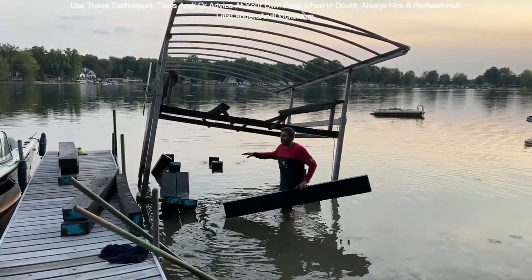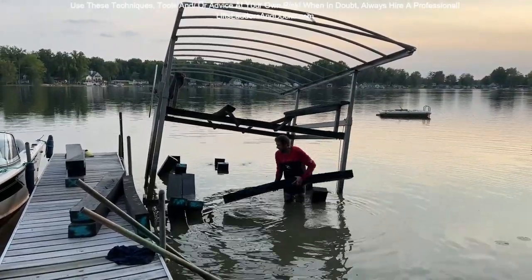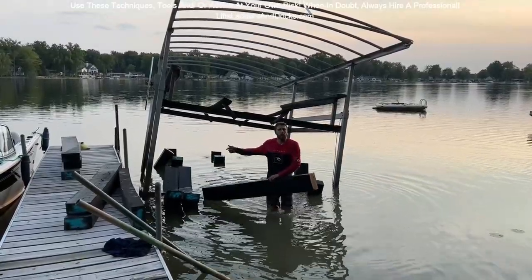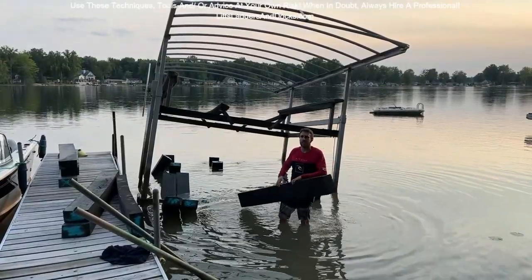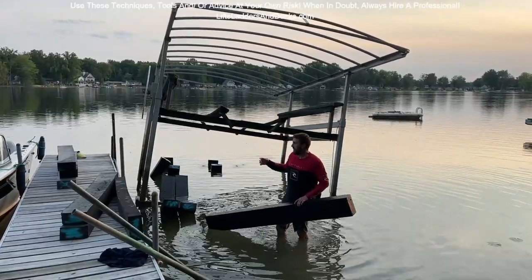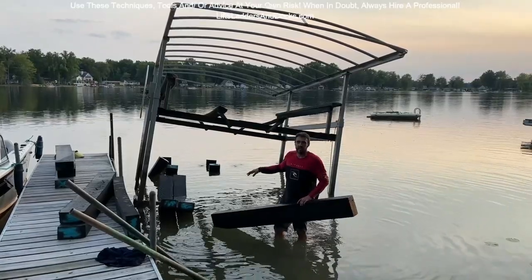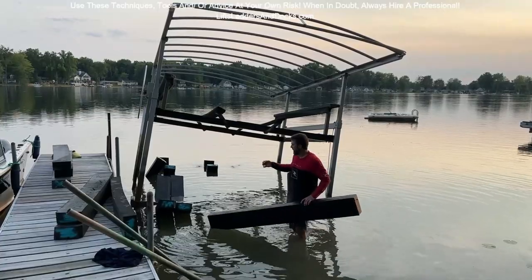But anyway, if that was the case, next thing we do, crank this cradle down, get enough of a gap between the cradle and the bottom spreader bar, put a rope or a chain or a ratchet strap around it, we'd start feeding our strips into there until it would start to pop. Constant steady pressure is how you defeat the muck and that Chinese finger trap kind of hold on it. Usually the harder you pull, the worse it gets stuck, but just the constant steady pressure, and if you walk around the feet, it can help get air in there, release the suction on it as well.